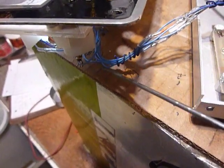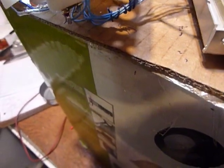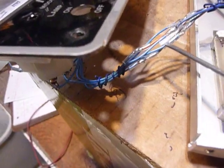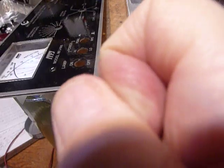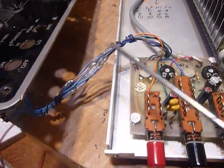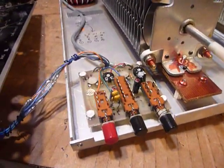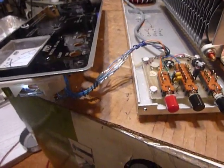Another thing I did on this unit — you can see I extended the wire leads that go to the meter area. There are six of them here. I extended them all by cutting little four-inch pieces of stranded thin wire, same size as what they had, but I only had blue. I put a small piece of heat shrink over each joint — simple U-joints, bent the wires, hooked them together, squished them down, soldered them, then slid the heat shrink over and shrunk them with a heat gun I got at Harbor Freight for about $9.95.